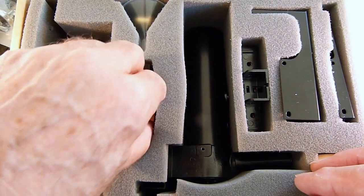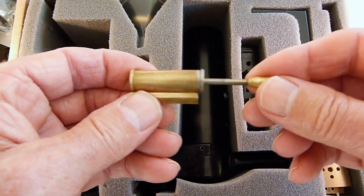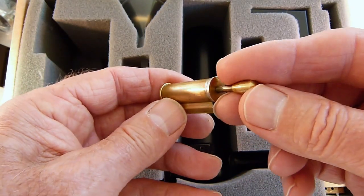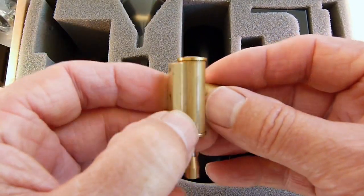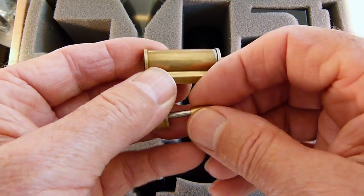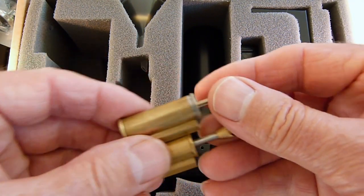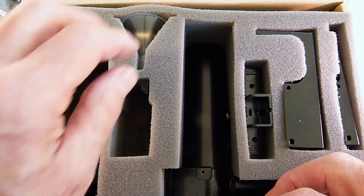And tucked away, this one here, what's this? This is a piston cylinder assembly, which is all combined, ready to run, riveted at the back there, which is all part of the structure of making it steam tight. Two of these, and they go in, they go out, nice and smoothly. Bit of oil, bit of water, steam and water in that, and they'll just be perfect the way they run.